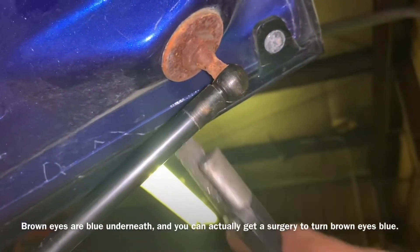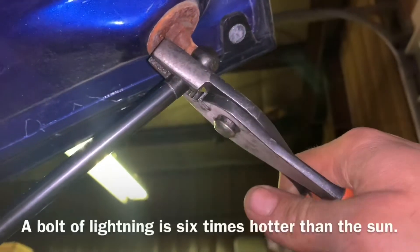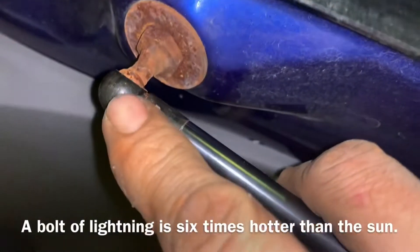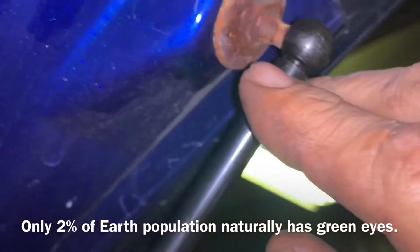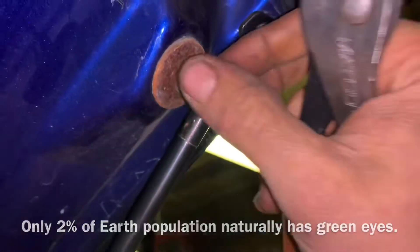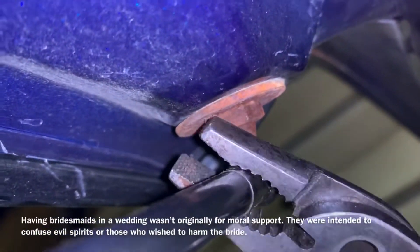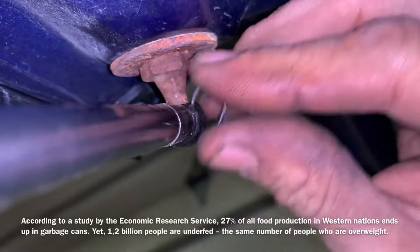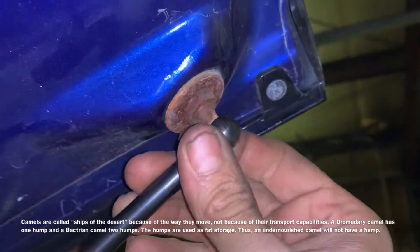Remember what I said — we want that eyelet to be half the hole. So pull it like that to where it almost comes out. If you look at the other side you can see how the ball is protruding out, and that allows us the ability to stick the clip up in there. Hopefully it'll go straight all the way through — maybe give it a couple taps. Then, taking our pliers and looking down through the hole, we can see when it's not restricted by metal, so we should be able to slide the clip in there. Voilà, done.